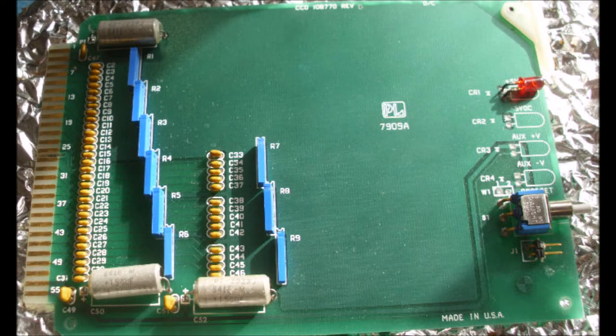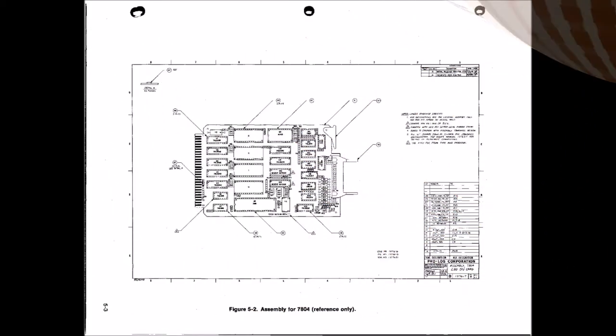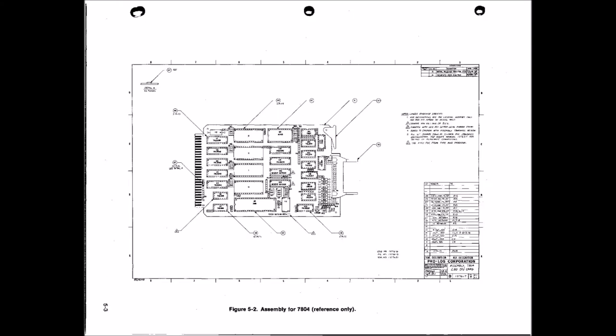My first job after graduating high school was writing 8080 and later Z80 assembler for a computerized process control system. The hardware was based on the STD bus. The cards are 6.5 inches by 4.5 inches. A typical system included the following cards: a processor board with 4K dynamic RAM and 8K ROM, a CRT controller board, a battery-backed static RAM board with real-time clock, and parallel and serial I/O boards.